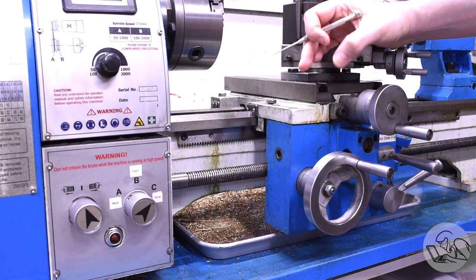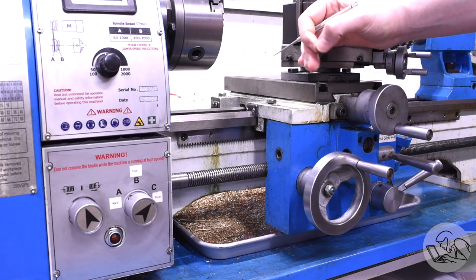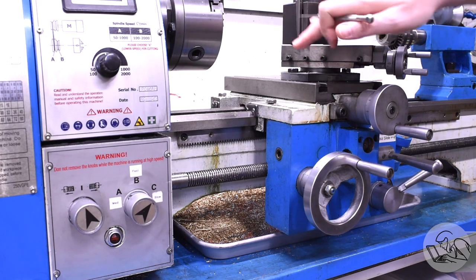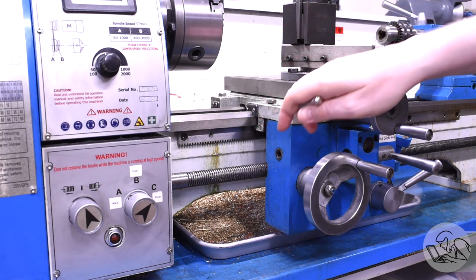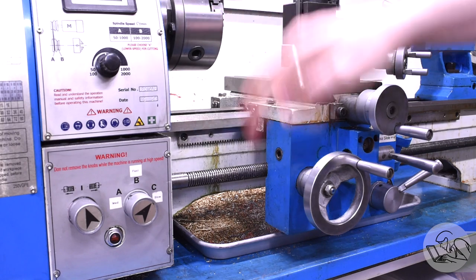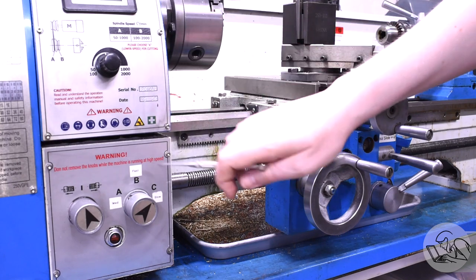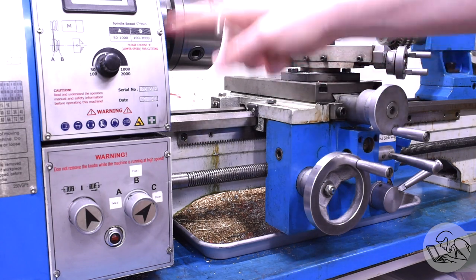But I'm not going to stand here and tell you that this is necessary. The well-intentioned theory that a lot of people go into this with is that rigidity is everything in machining. And therefore, you can assist the rigidity of your machine by bolting it to some super crazy rigid bench. That's probably true to some degree, but I think a lot less than you might think. Really, the primary losses of rigidity — the critical loop of rigidity on, for example, the lathe — is really here: it's between the tool down through the tool post and the slides and then back up into the chuck. This loop right here is what's critical. Bolting this loop onto something really heavy is probably not actually helping you that much.